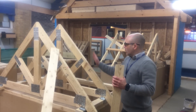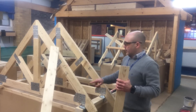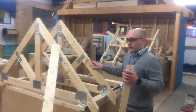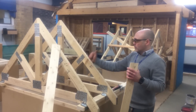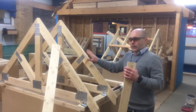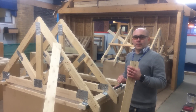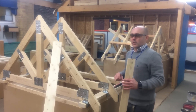We've got the second one in position and tacked it at the bottom. What I forgot to mention is that when you get the trusses delivered on site, there will be a line on one side — that's just to tell you to keep all that line pointing the same way. Trusses have been made in a jig, so it's just the way they came out of that jig — you want them pointing the same way. Usually there's not much discrepancy, but just to be on the safe side, keep the line facing the same way.